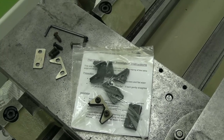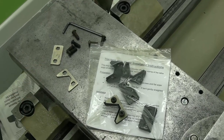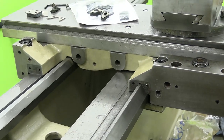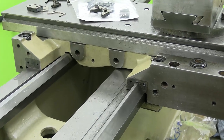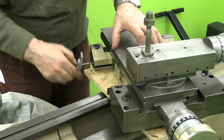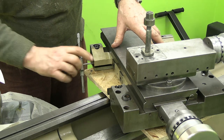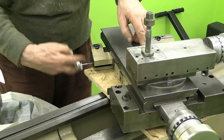I've got some rubber V-way wipers off the internet, and I nickel plated these old metal fitments. What I've just realised is that I should have chased these threads before I put this saddle on here. Luckily I can slide the saddle off the end, but that's something that should have been done when I had the thing in a more convenient place. This is definitely something I should have done before when I had the saddle naked — because with the cross slide on and so on, it's hard to balance it on its end. Anyway, we'll survive it.